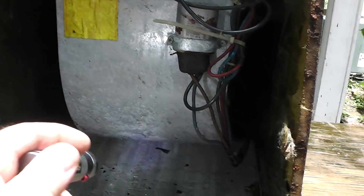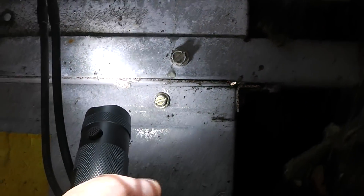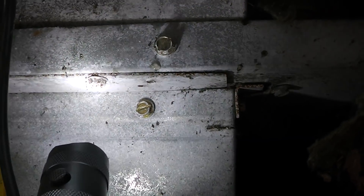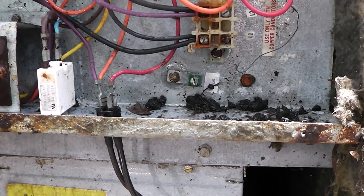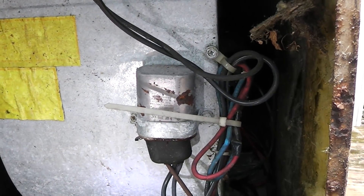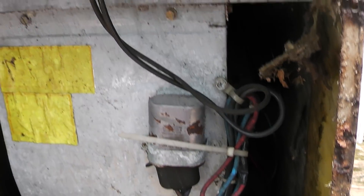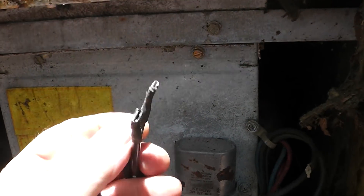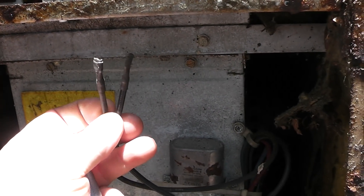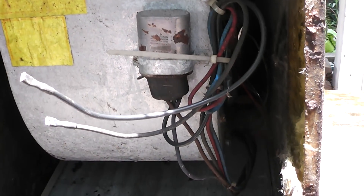You get a flashlight. Now, yours might be on its side, but it's still going to work the same way. If you look right there, you can see that screw right there where the light is, and that screw right there — not these, but those two right there. You pull those out and that thing should slide out. You need to make a notation of the wiring. This is a 240-volt or 220-volt blower motor. These two wires — it doesn't really matter if you swap them. Now, if you have a circuit board, or if this is a 110-volt motor or a three-phase, then it makes a difference. But for your typical application like this old one right here, it doesn't.